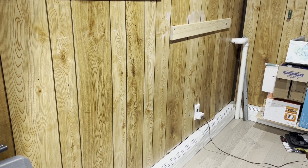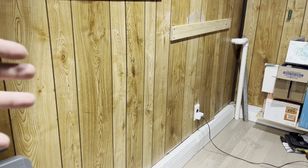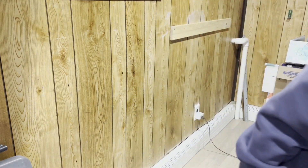If you're going to put a lot of weight on this, I would not use drywall anchors. It probably doesn't make sense if you're planning to hold over 100 pounds. I have kids here and if two kids at 50-60 pounds each put their weight on the table, I don't want an issue. These brackets are rated for 440 pounds, but even 200 pounds with just anchors in the wall probably won't work — you'll want to go into a stud.